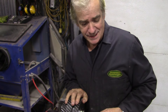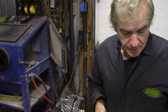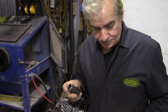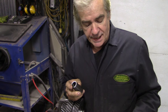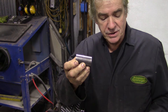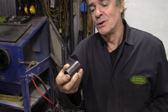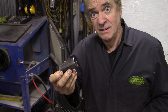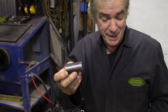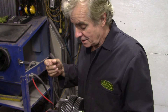These solid bushes are really good. We make our own - if you were to buy these from Land Rover they are incremental, starting at 58.35 millimeters, and there's a whole range of them at around 21 pounds each. That's expensive to get a load of them and find out they're not right, so we make them at 59mm and just turn them down to suit.